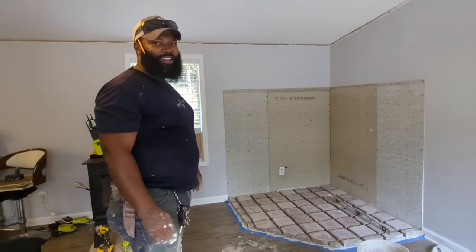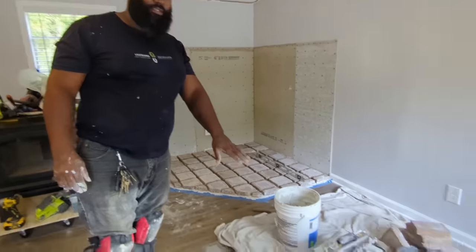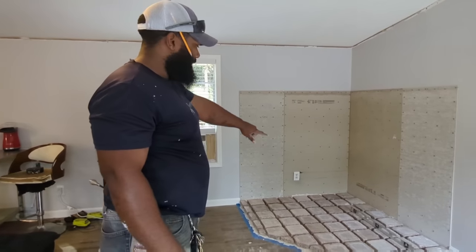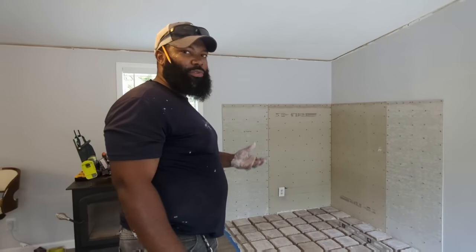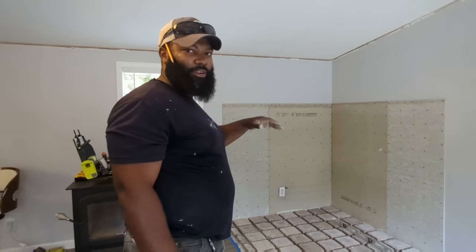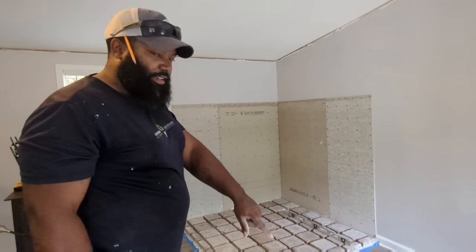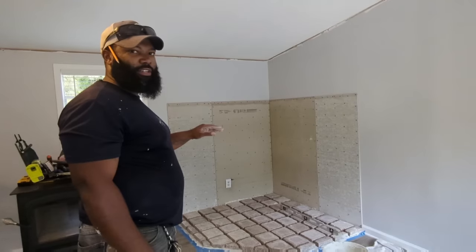Y'all actually get German schmear in this video. Yes. Awesome. We got the self-leveling grout, cement. Because we're going to do self-leveling cement in the middle of the grout lines to make sure we don't have to use too much grout for the German schmear. Because if you use too much grout, it may crack. We're trying to avoid that. So we're going to build it up just a little bit in those grout lines with the self-leveling concrete. Pour that in there about halfway and then fill the rest up with the grout for the German schmear.